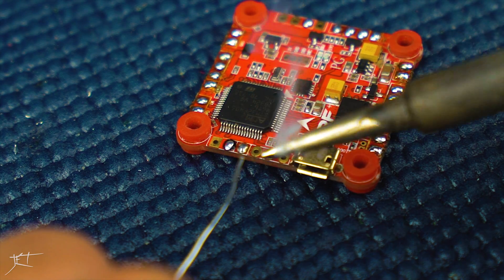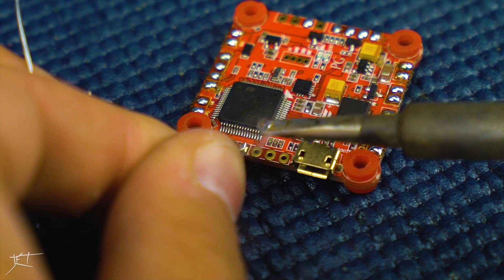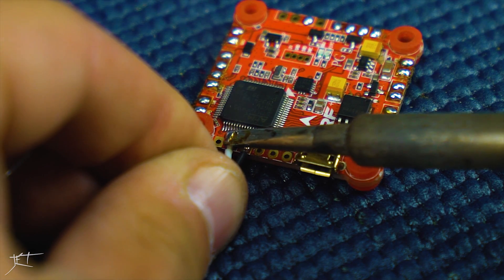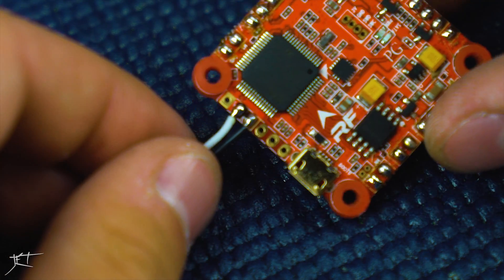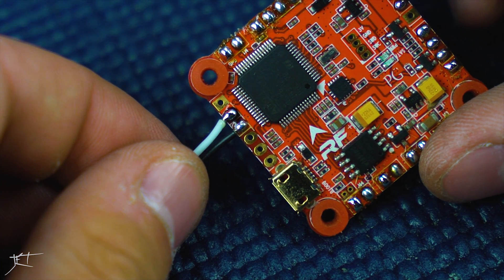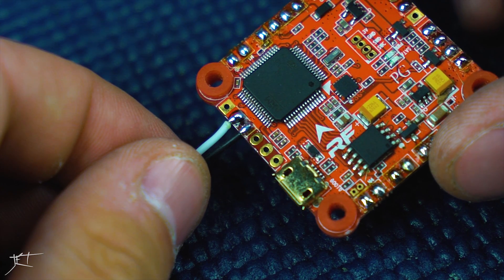Next up, you get to solder the wires to the pad. You tin up the iron, hold your wire and the pad together, and just tap it — it's a very quick process. This is real time, so if everything's tinned up properly and your iron is also properly tinned, it should really only be a second or so that you hold it on there.